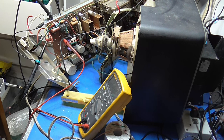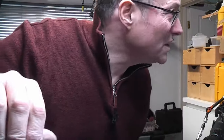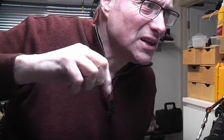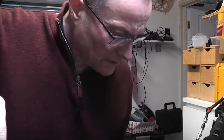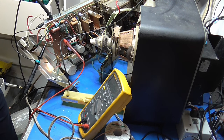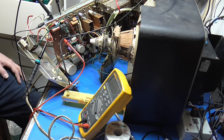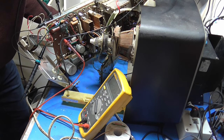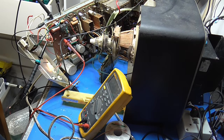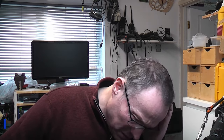So it's auto set. You can't see that because I haven't got scope cam connected, have I? Right, there is a line drive waveform there. It's a bit squirrely, but it is there. And it is about 14 kilohertz, so it's not far off the line. Were we DC coupled? No, we weren't. Let me just DC couple and try again. Okay, well, it's swinging around negativeness, so that's okay. So our line drive's all right. Our power supply seems to be happy.